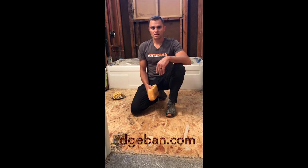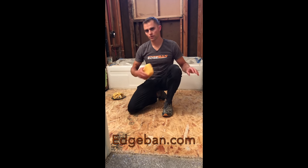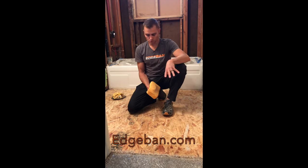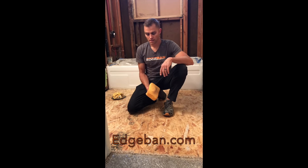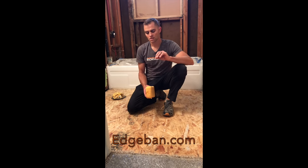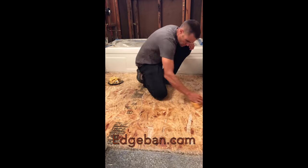An important part of this process is that you get your floor really clean. So you maybe have torn out some old flooring, and now you've cleaned up your floor, you've gotten most of the debris off of it. You want to vacuum the floor really good, get all the dust and even little pieces off. And then as a final step, you just want to take a damp sponge, not very much water in it, and get that fine dust off. We are going to be using a primer on this floor, and so you want to make sure your primer is going to have a very good adhesion to the wood substrate.